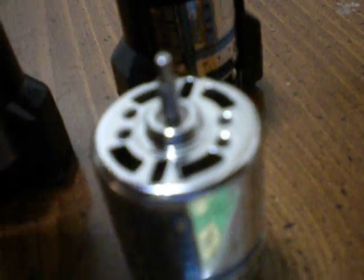I'm going to give a demonstration. It's very hard to see because these parts are so shiny. The bushing fits on the end of the shaft — maybe like an eighth inch from the top of the bearing, maybe less — just to where you've got a space above the bearing. Basically what you want to do is glue it on there, and then take the pinion and put it on top of the bushing.